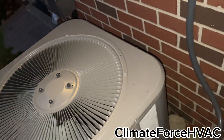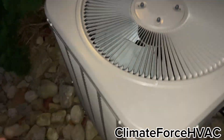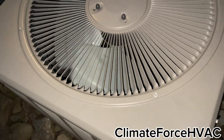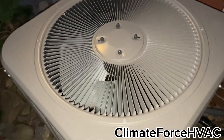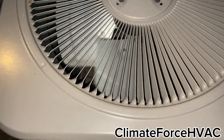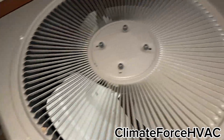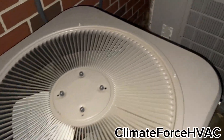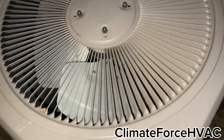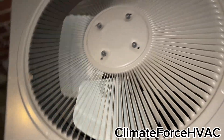When you run it with low refrigerant it can also overheat the compressor. My mom shut it off from her phone — nice to see her sitting right there in the window. I don't want to overheat this compressor, that's the last thing I want to do. This unit's not worth fixing really — it's got a leak somewhere, it's 10 years old, and it's only a 13 SEER.